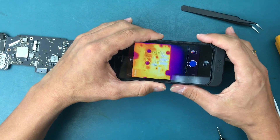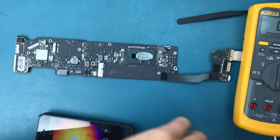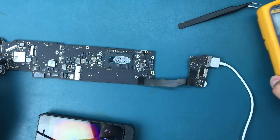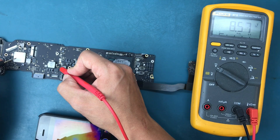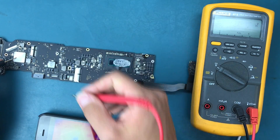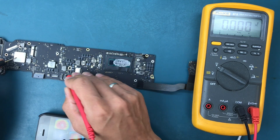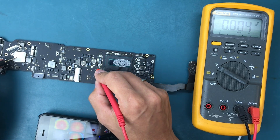There's no definite spot of the short glowing anymore. Let's read the voltage on that 12-volt line. We get 8.6 volts - MacBook Airs have 8.6 volts, while the Pros have 12.6. No jumping, no pulsating, nothing. And of course the processor side will have nothing - we're probably going to see 3.3 volts but no 5 volts. That's the 3.3 volt coil, that's the 5 volt coil, nothing - and of course everything past that point is not present because of the major short on the line.